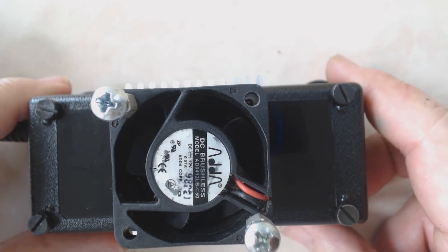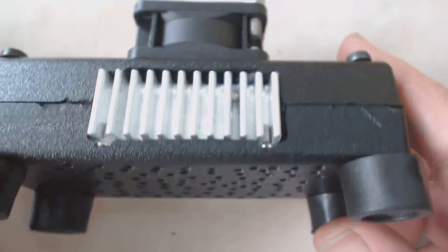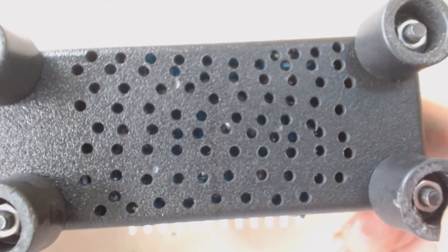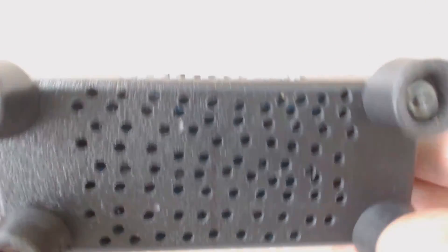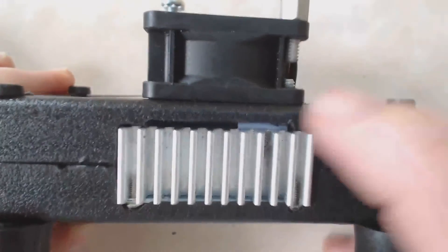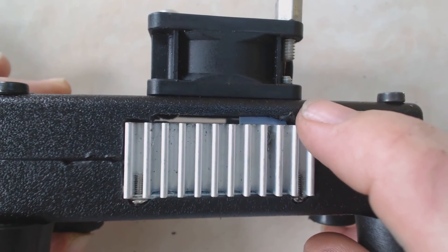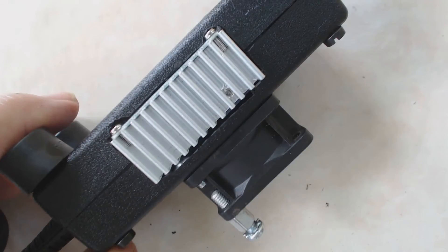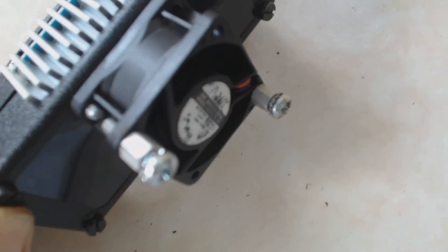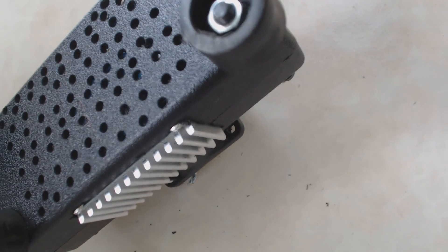The fan is an inch-and-a-half unit from a 386 or 486 CPU cooler. I've drilled holes in the bottom to allow airflow to come in from the bottom and exit at the top. There are also two slots above the heat sink that allow air to enter and keep the heat sinks cool. The bolts on top of the fan are there so that even if the unit winds up upside down, it can still breathe.